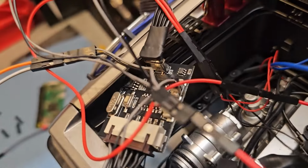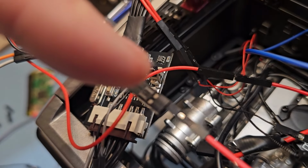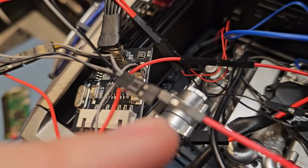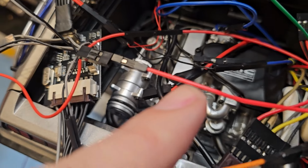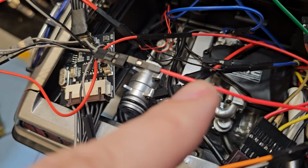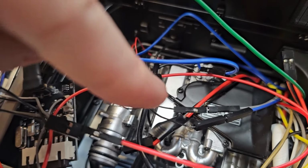What I've actually done, as you can see, is I've used the split cable. So that's a JST to 2 sets of DuPont leads. This one is the important one, or part of the important one. This one goes off to the positive side of the flux capacitor and the tree SID. So that gives it its permanent 5 volts.